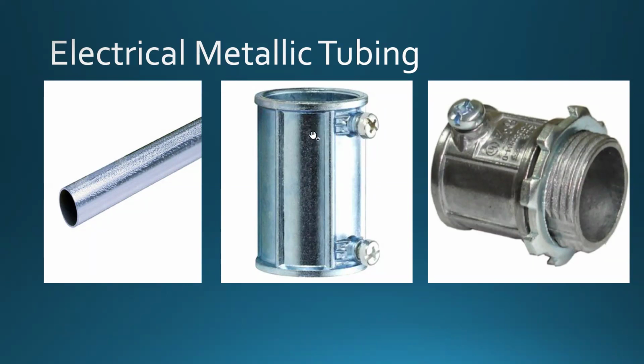So what I would do, if you ever have that situation, is put the pipe in, set the screw, and drill a hole right here, through the coupling and through the pipe that's installed. And then I use what's sometimes called piano wire, or aircraft cable, or steel wire. Just thread that through, make a loop on this side here, make a loop on this side here. This way, if anything happens, if anything lets go, you're secured by those connections or the loops.